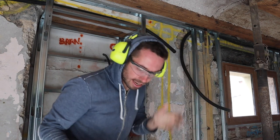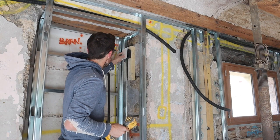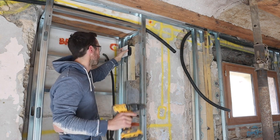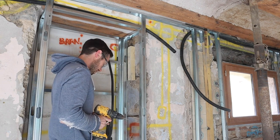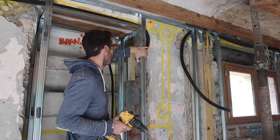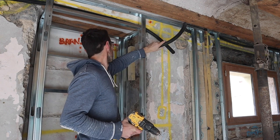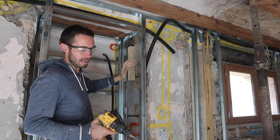The reason I'm doing this is to put in an electric back box. The box needs to stand out from all the plasterboard just a little bit, enough so that when you put the cover back on it's flush with the plasterboard. I put a few holes in, fix it in, and then this will be one of the boxes taking the ring around. It's a bit of a bend but I can pull the cables through before I fix it all in the box to make it a little bit easier.